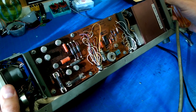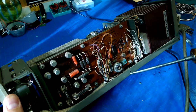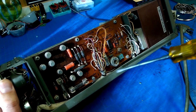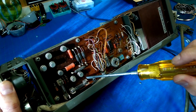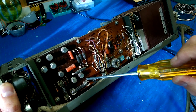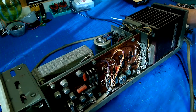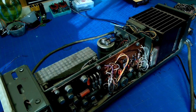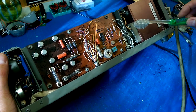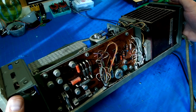And yeah, so it's a linear power supply. Fuses are inside here. We've got two 3-amp fuses. So that would mean that somehow line voltage is coming into here first, I would presume. If it's not fusing line voltage, that would be unfortunate. But it does need a good cleaning. That's 100% for sure. FBT034, a Motorola IC. Wondering what that's controlling.